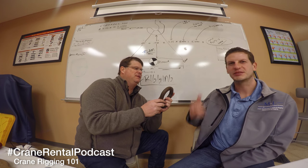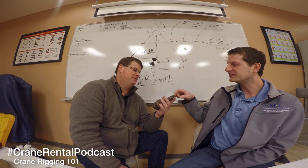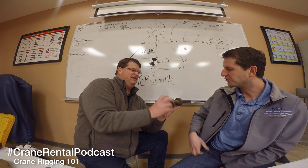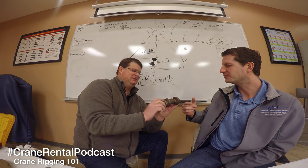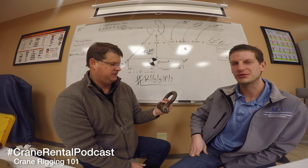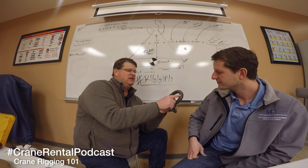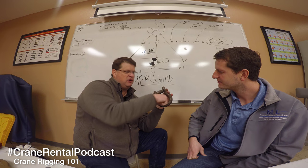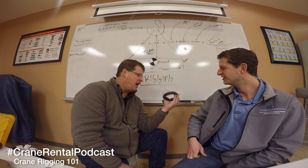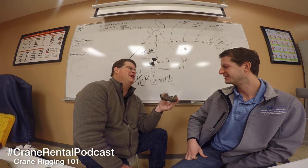We talked about how long a shackle can last if properly maintained - this obviously has not been properly maintained, but it still seats properly, which is surprising. I'd expect nothing to line up, but look at it - they're lining up. It's rated at eight and a half tons, 17,000 pounds. I think it's a Crosby. It's really my perfect example of how to inspect a shackle and all the little things you look for.